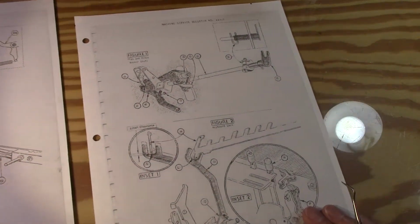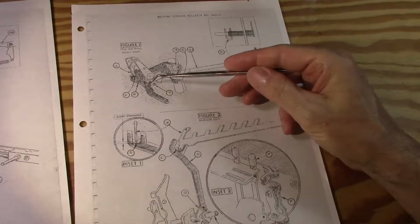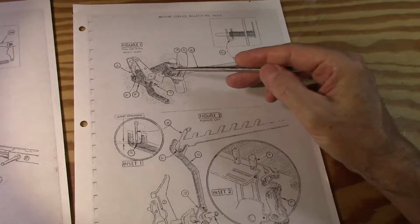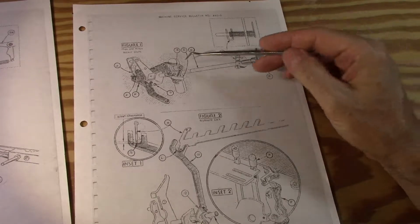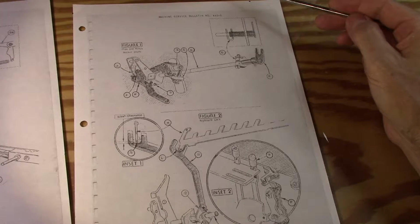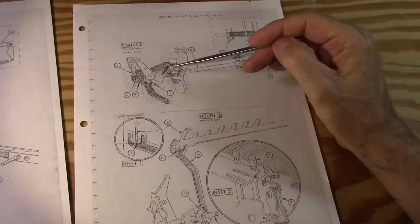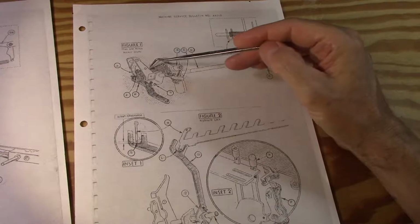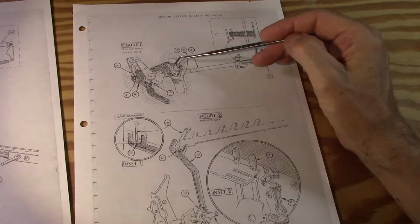So what I found is that if you adjust, there's two little screws here on this little plate that kind of biases the position of the output of this shaft that goes up ultimately to those key buttons, those addition to subtraction buttons, and that biases this arm that then goes through the side plate.